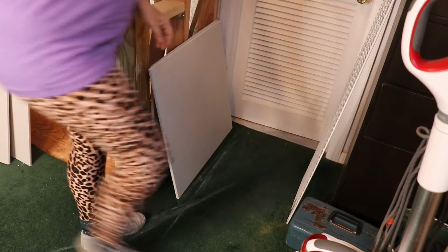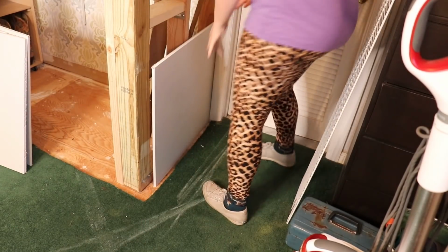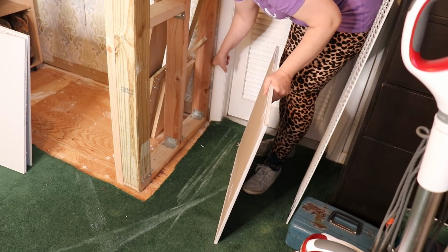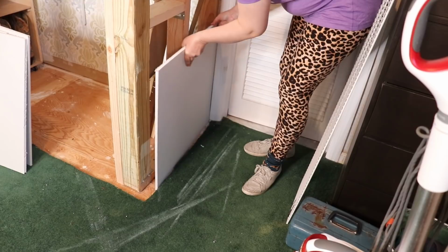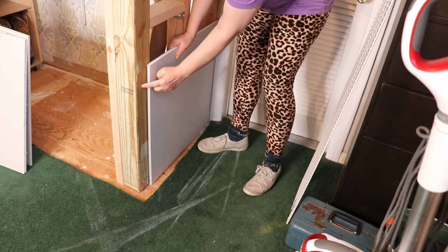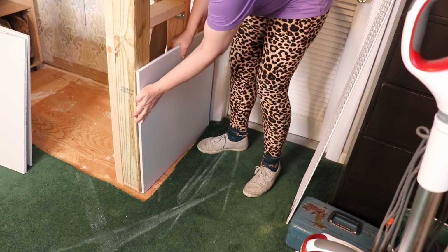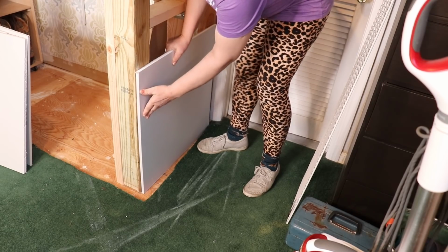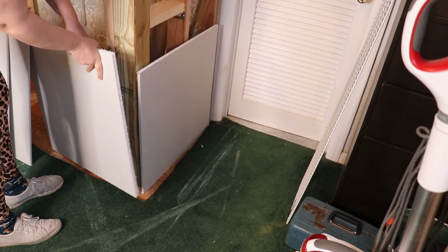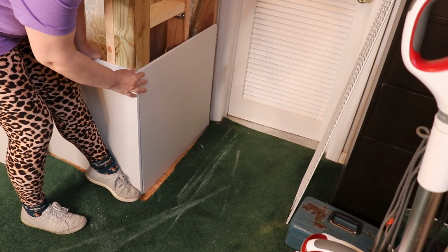This is the side that goes to the bathroom, okay? You see how it leaves that stuff everywhere? So if you remember, I kept a 1/2 inch here from the door frame because I had the intention of putting the sheetrock in it, right? And it fits right in. So if I do this, then I have about this much missing, which is not a lot. So what I'm probably going to do is move this here, flush here, and then the next one for the front will go over it like this, right? So this will get patched.